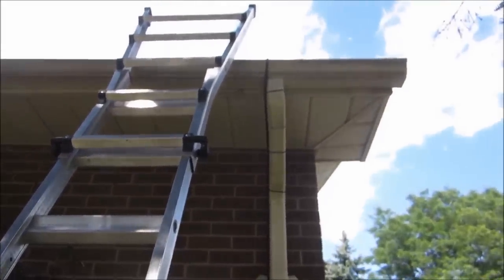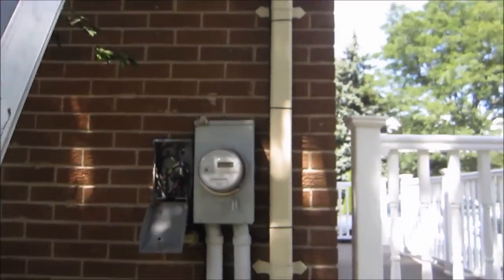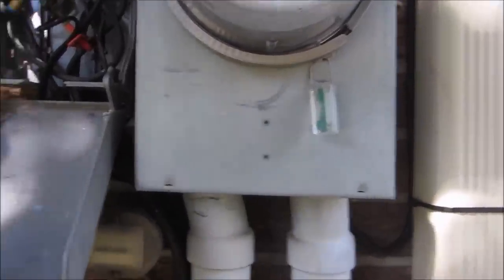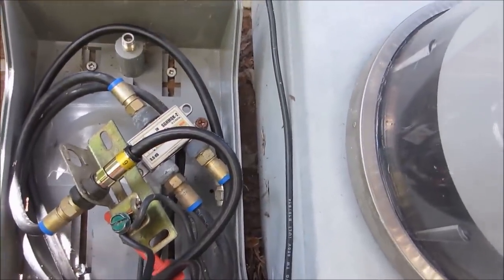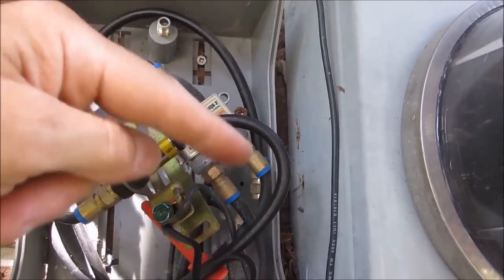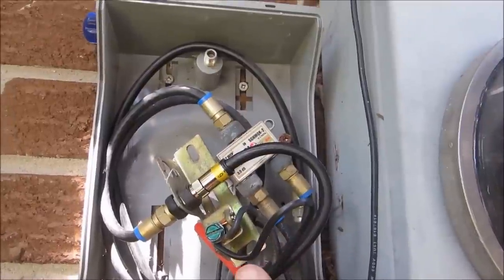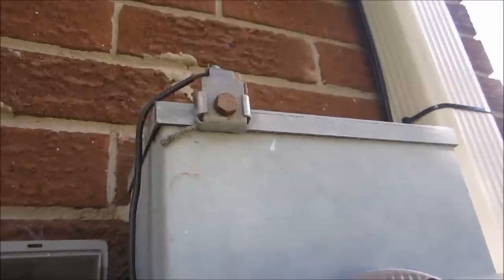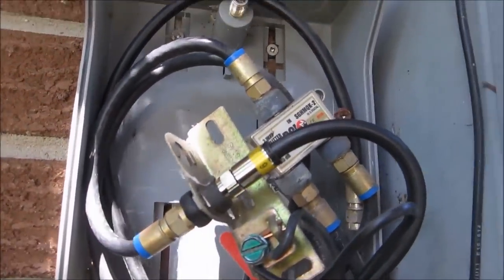The cable is now just visible coming over the eaves trough. We've strapped the cabling down the inside of the eaves trough — it's nice and neat, running behind the hydro meter. It comes up into the cable box where we've disconnected the main Rogers feed and connected our main antenna feed into the ground block. It feeds through our two-way splitter to feed the two TVs. We've also taken the messenger ground from the antenna up top, so the antenna and mount are grounded by this wire up to the main ground of the house off the hydro meter. The coax is also grounded through the ground block.